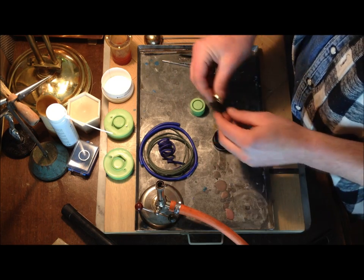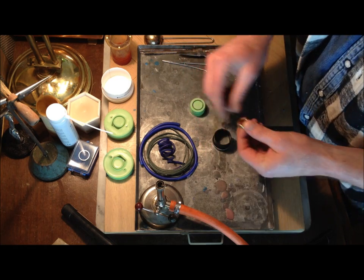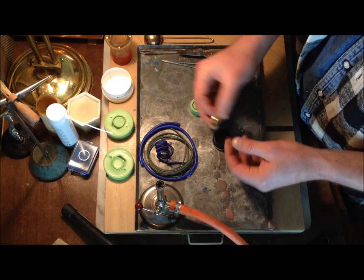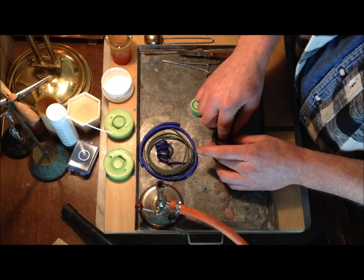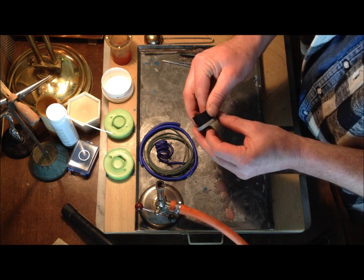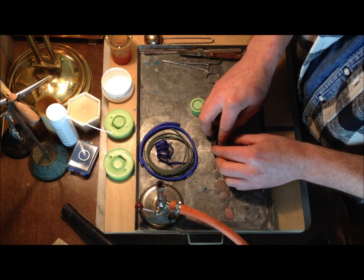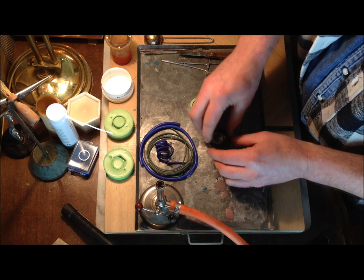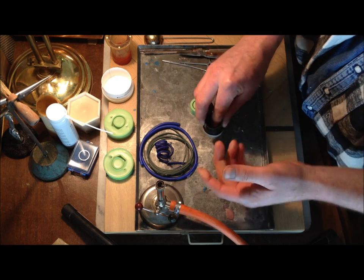First of all, you can get a ring or something you want to copy, you can make it out of wax on your own, or else like I did, just cut it out of a piece of pipe, polish it a bit, put it on the bottom of one of those old film roll canisters, and make sure to just cut off a bit and keep the lid on the bottom so you can take it off afterwards.